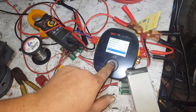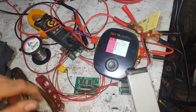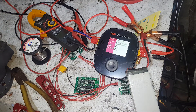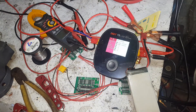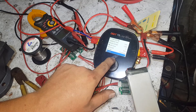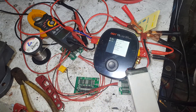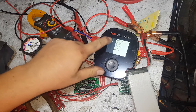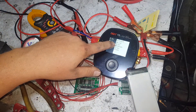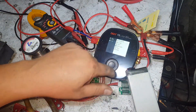We've got 2S. We'll see what it does when we try and discharge it at 2S. There's a bit higher of an amperage. We'll just charge at 1.3 for a 2S battery there - still isn't anywhere near as high as I'd like, but it does discharge. The working info shows 12.9V as our input battery voltage, and 34 degrees C inside which is not really a surprise because it was just discharging.